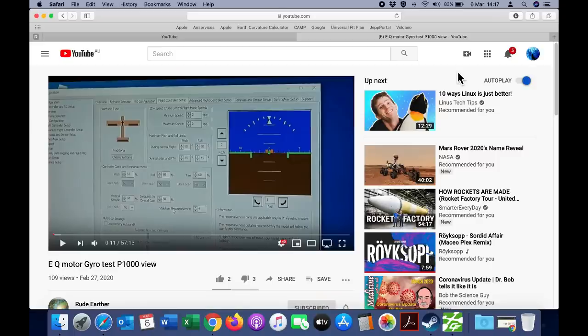The flat earther conducting these experiments goes by the name of Rude Earther, and this is one of his videos showing the artificial horizon indication in the software from his own controller. While he can be true to his name and post quite rude comments, I have been bantering back and forth with him for the last two weeks, and he's actually not a bad guy — so please don't give him a hard time. He's out there trying to do these experiments himself. What I have explained to him is that the indication in his artificial horizon is coming from the accelerometers in the flight controller. If he was able to disable those accelerometers, it would show no movement, as I indicated with my own just a few minutes ago.